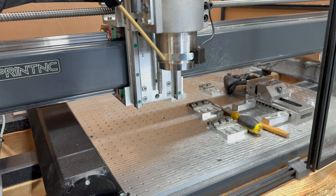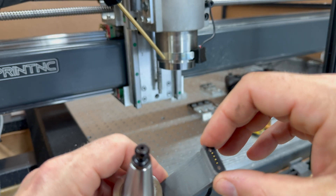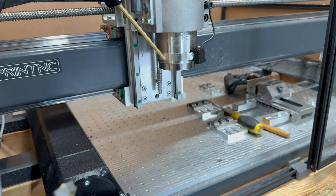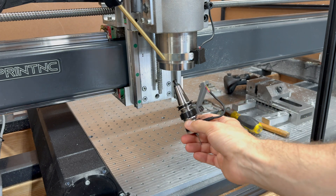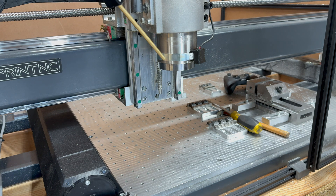He found an incredibly simple but genius way to utilize the cheap Chinese 3D touch probes that we all use with his ATC spindle. Basically, he uses cheap magnetic pogo pin connectors that you can get for a few cents from China, eBay, or Amazon. He took a USB-C cable, cut it in half, soldered one end to the male side of the connector, and the other end is connected to the spindle. Whenever you load the probe with your ATC spindle, the connection is established by these magnetic pogo pins. It's genius — I wonder why no one had the idea before, and I thought I have to copy that for my system.